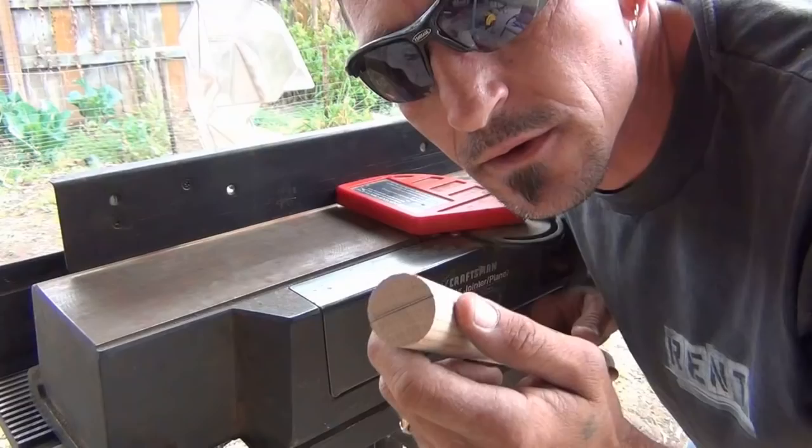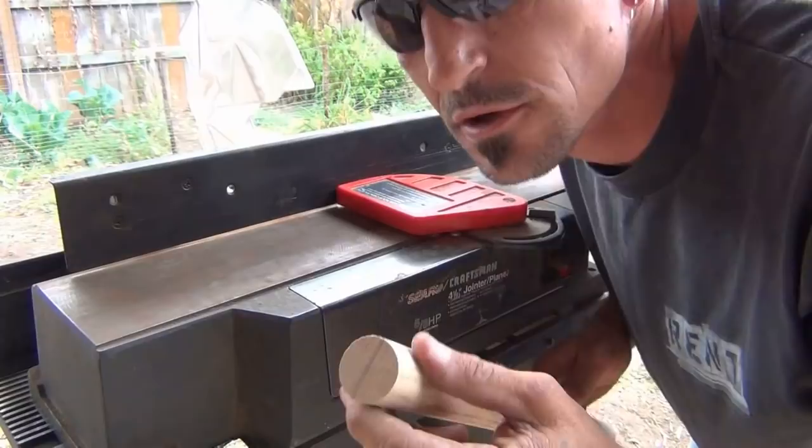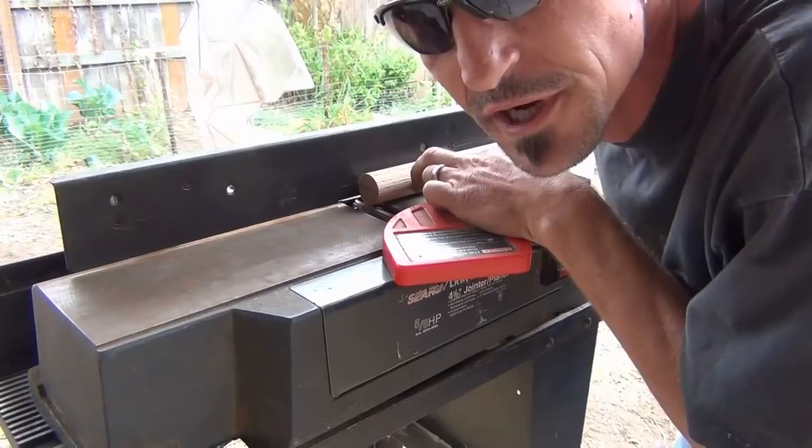Determine which side you think is going to be the strongest, and make sure that the opposite side is down. Take a very small bite in here, or it'll just chip and shatter, and if that happens, you'll be buying a new dowel.